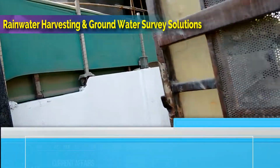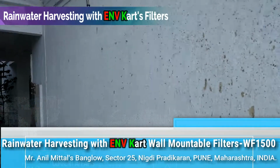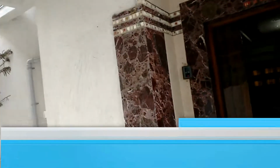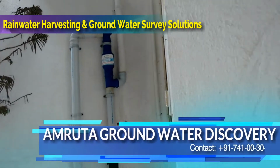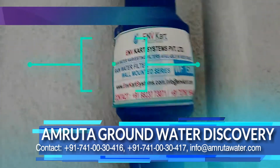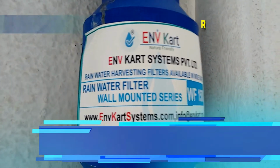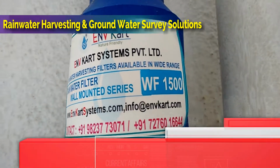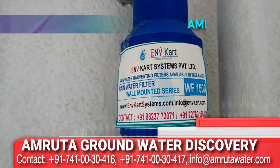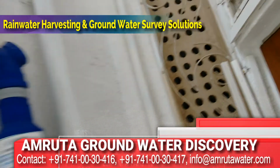I'll show you how the rainwater harvesting filters are now installed out here. Currently the customer has 3,500 square feet of rooftop area, and you can see it here. It's a wall-mounted filter, the ENV Kart Systems rainwater harvesting wall-mounted filter, and a WF-1500 is installed here. I'll explain. So this is the rooftop that is coming down.